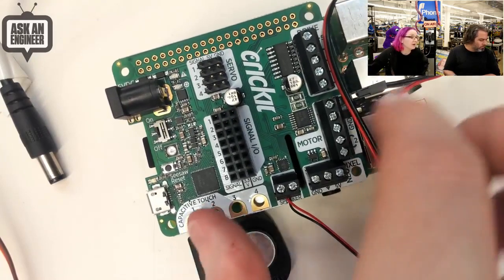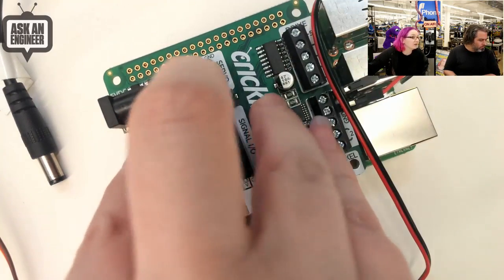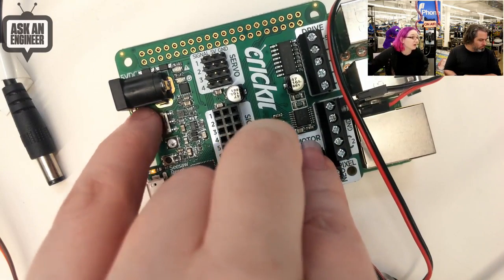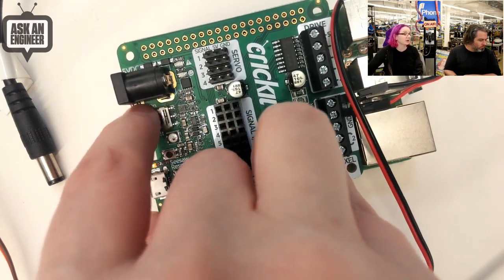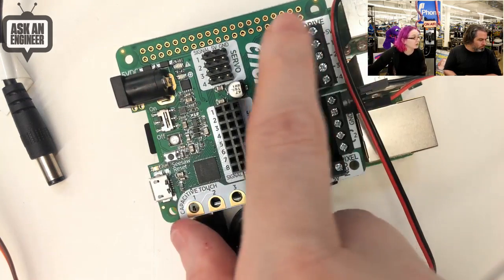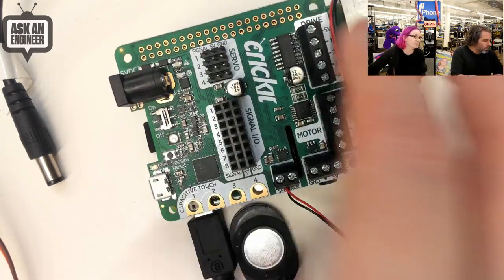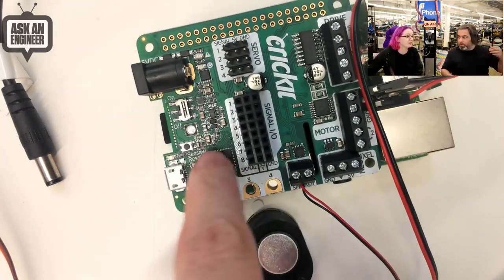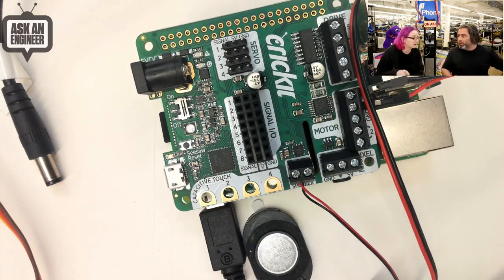You don't need to use the I2S amplifier. There are also two more pins you can jumper for IRQ, which makes it a little faster since you're not busy-waiting on I2C, but you don't need to use them. Other than that, all other pins are available — so you get maybe 20 more GPIO. Only I2C is used for the hat itself. This is going to be a popular product, so sign up for it — we've put in a batch and we're putting in more very soon.